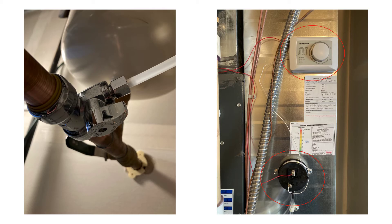On the left-hand side you see a SharkBite shutoff valve — a three-quarter inch by three-quarter inch push-to-connect fitting with a quarter-inch compression for the water line, which lets you turn the water on and off to your humidifier. I'd recommend buying one of these instead of using the piercing valve supplied in the kit. Those tend to leak — you're piercing a small hole into your copper pipe and they rely on rubber seals clamped onto the pipe. I don't trust or recommend those. Go with a SharkBite push-to-connect shutoff valve instead.